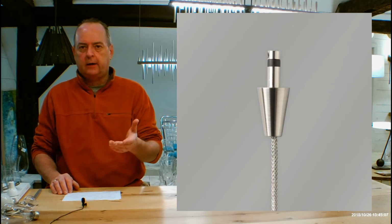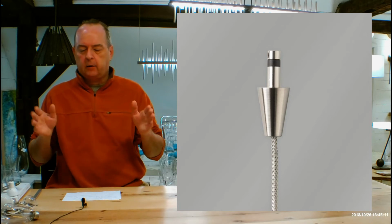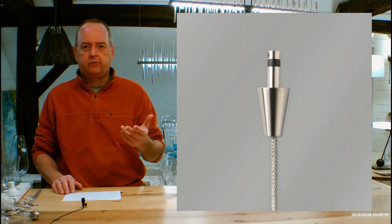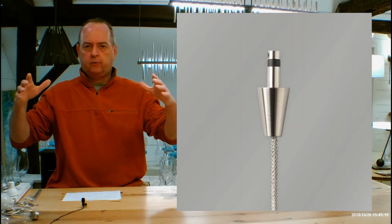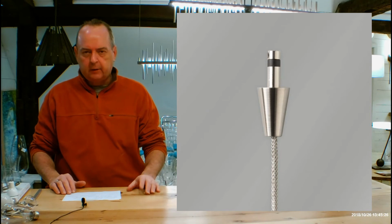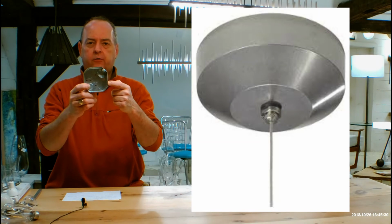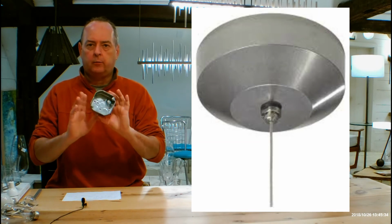Remember, when you do that, it's going to dictate where those are on the ceiling and how far they are apart from each other. However, there may be some installations, like if you wanted to do a large round version that has lots of little holes in it and you wanted to stagger these, that may be an interesting thing for you to check out. But if you're just going to be putting these over junction boxes, this is a regular 4-inch junction box in your ceiling, and you already have these in place, I would just order the normal regular one.